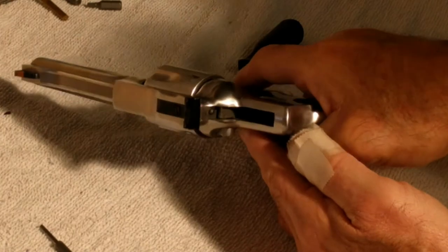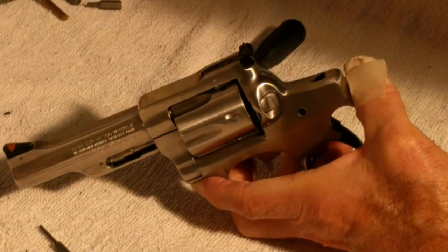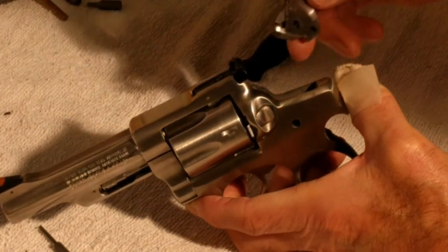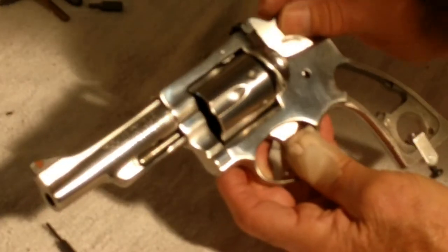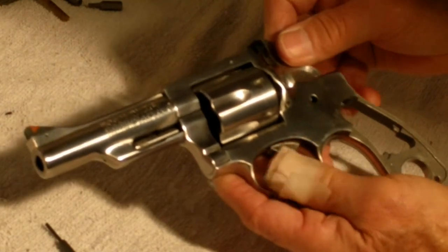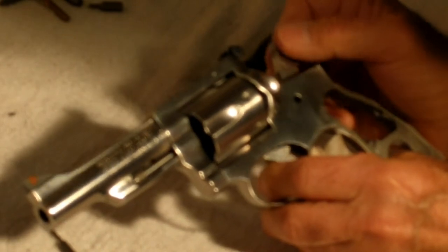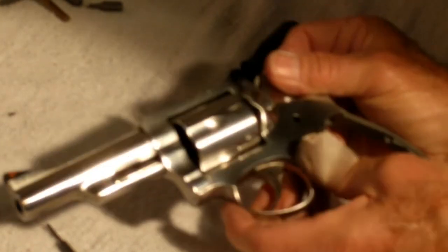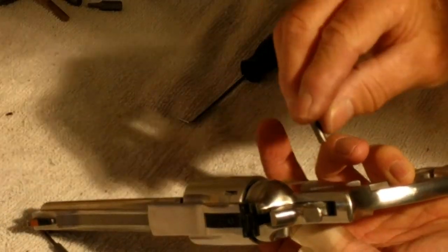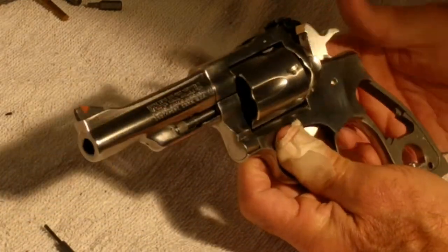You can see it slides up and down like that. So, drop the hammer down. Now remember, this goes easy because there's no load on it from the spring. Should go easy. Watch, I jinxed myself. You might have to pull the trigger back. There. I pull the trigger back a little bit. Get that hole lined up. This piece goes back, drops right in that carved out piece of the receiver. All right.